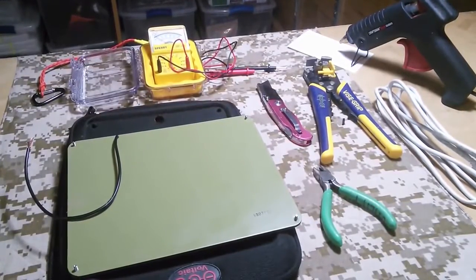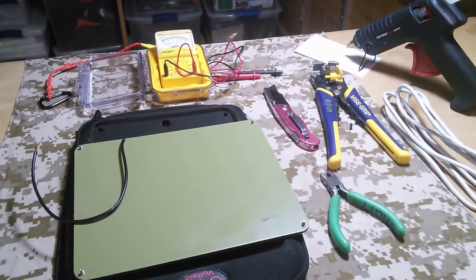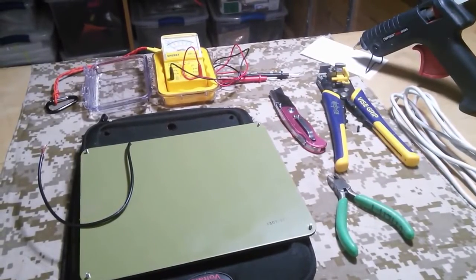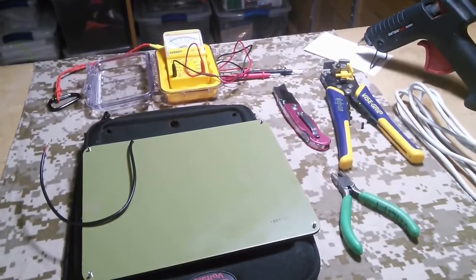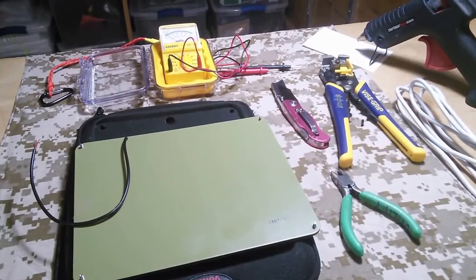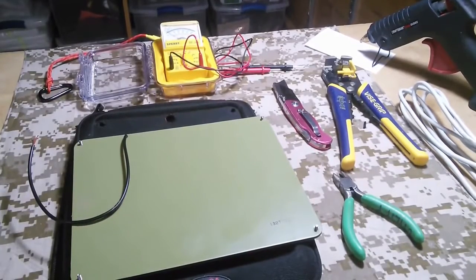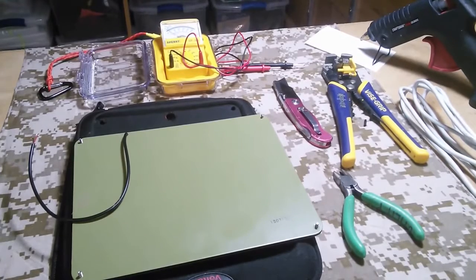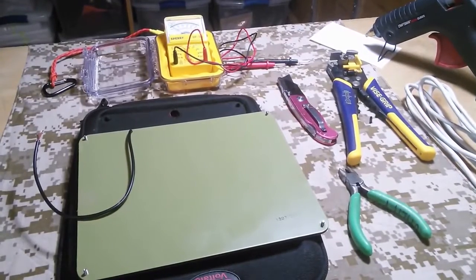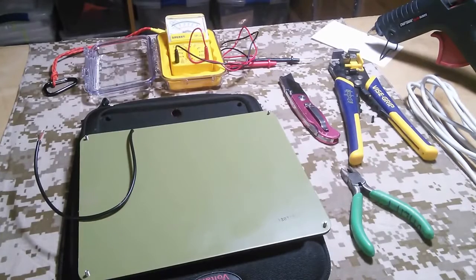I've done some other mods to it in a different video. But lately I've been fighting with the cable and the proprietary connector with an extension piece — where it goes into the V15 battery is just a micro USB connector — and as I noted in the other video, it doesn't connect all that well. I started to think that I don't have anything that this round 3.5 by 1.1 barrel connector goes to. I believe that's used by Voltaic when you chain multiple panels together. That's not how I use this. Most of the time it's going to be plugged directly into the battery, and then the battery into my phone, tablet, etc. If I do want to connect something directly, I would still have to use the converter to get it to micro USB.